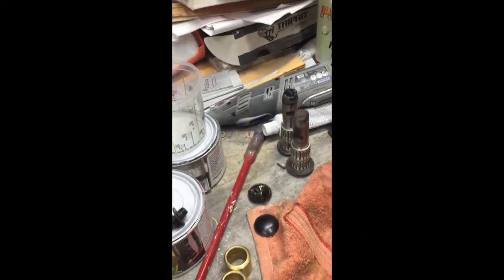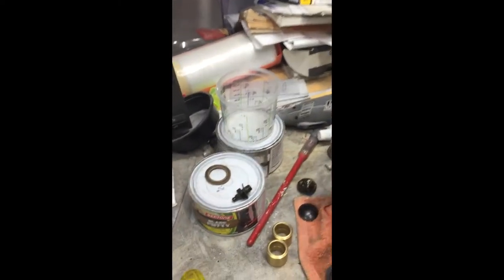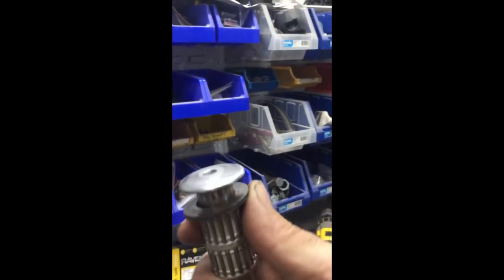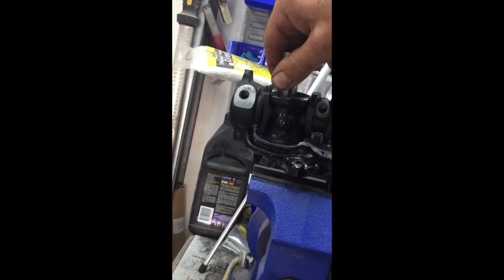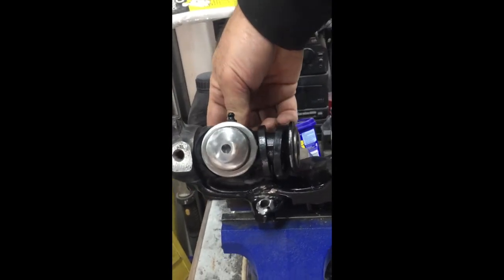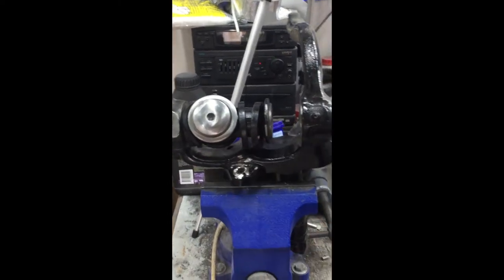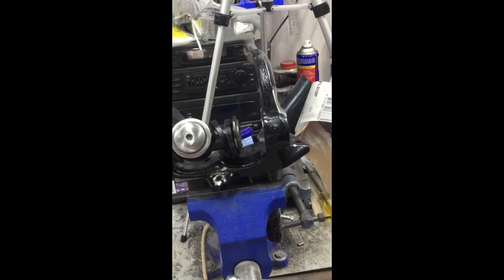When you put the pin in - and you can see what I've done to the pin - there's a stock pin. You can see the profile of that. What I've done is I've just changed it, taken a bit of material off - I've just kind of domed it. The idea is once you pop that in here and you rotate it, you can see it just clears. That's all you need - you just want it to clear without hitting anything. That's perfect. Just by taking a little bit of material off the top of that and a little bit here, you can get away with it without grinding a crap load out and having to do this welding business on the outside, which I don't want to do.